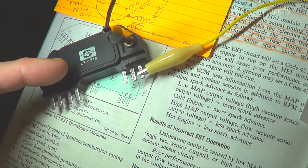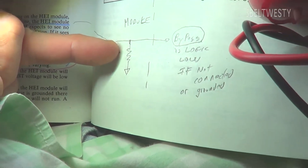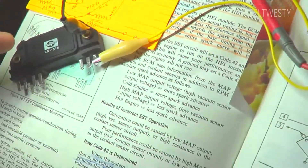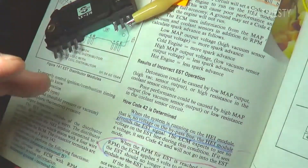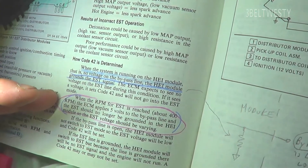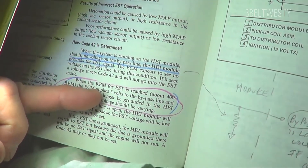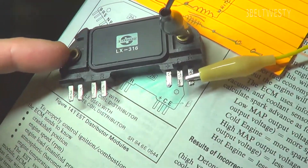With no connection on here, this is going to be pulled low. The internal resistor I measured is 9.2K ohms, and so 5 volts is going to pull that high. The computer applies logic high, which is 5 volts, to this line, which is B on the module.